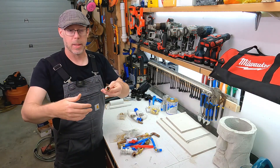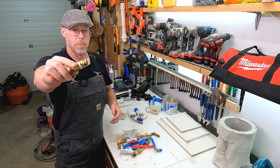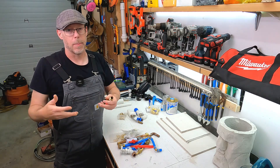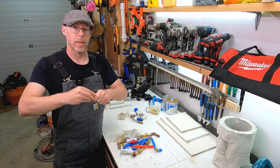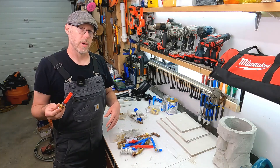It's kind of a permanent attempt at a repair. If it doesn't work, now you have a much bigger problem because you can't just unthread this — you're going to have to do more extensive work, probably cut and replace some pieces. I'm just holding a small threaded brass connection, but what if it was something bigger, like a large brass valve? That's going to be expensive, and now you're going to have to replace it because you've gunked it up with that permanent repair epoxy. That's not the move.